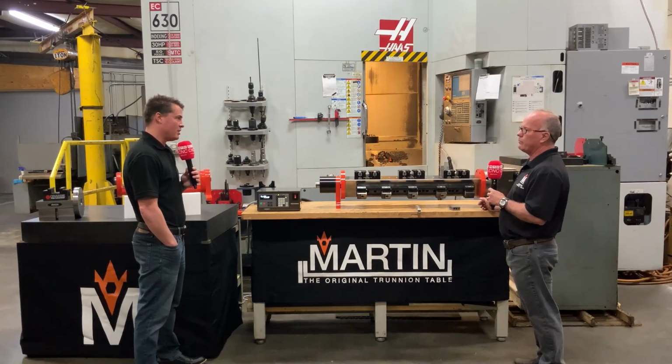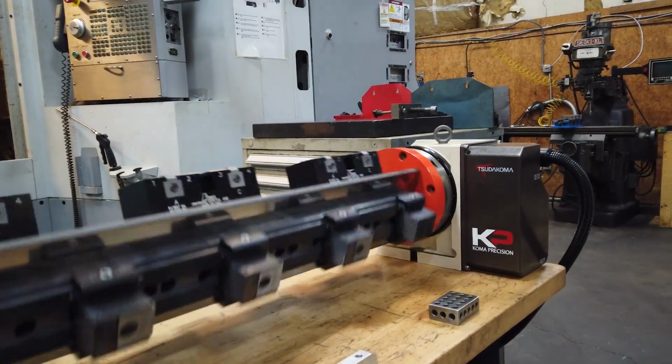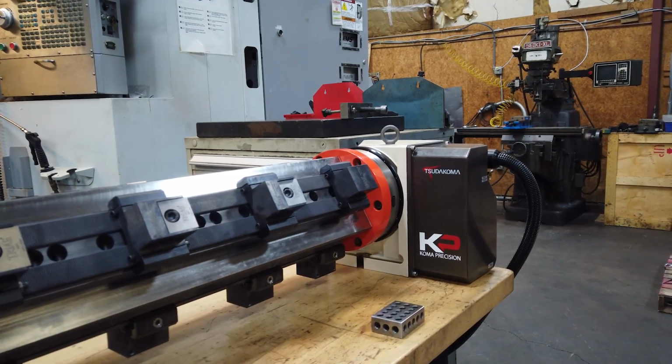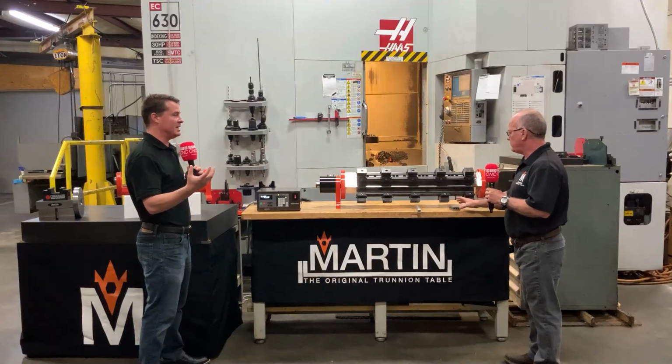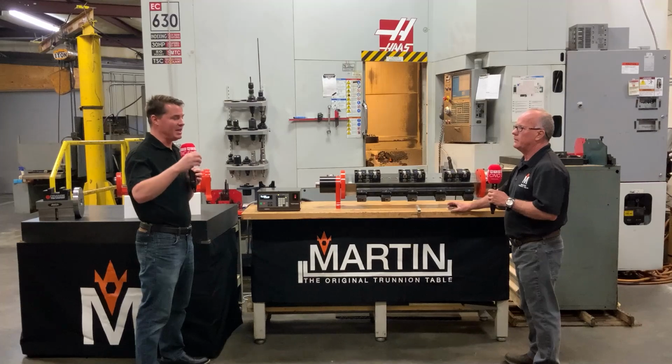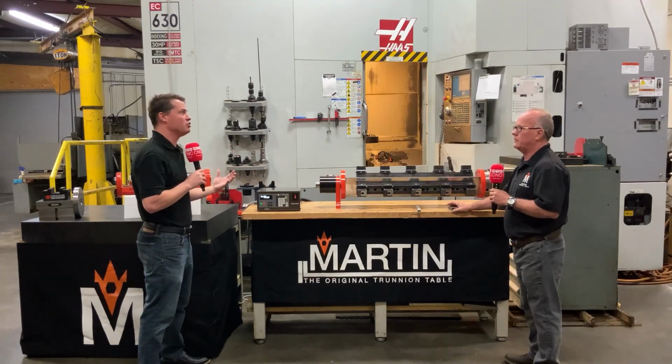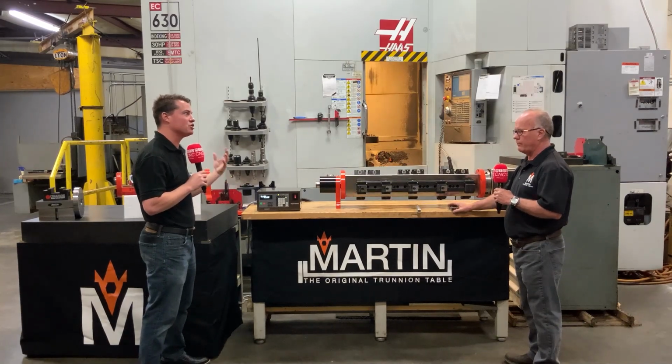Virtually anything. So I know a lot of companies that have these great pallet change systems. And some of the advantages to that are the fact that I can run 6, 7, 8, however many pallets I have, individual products without having to run 100 products at one time with this pallet change. It just repeats itself.